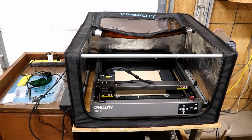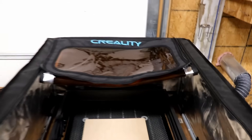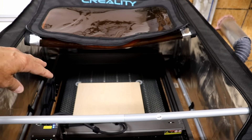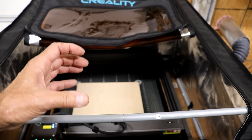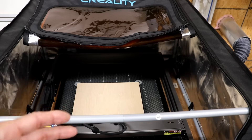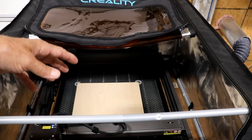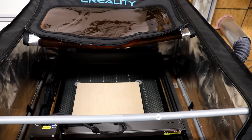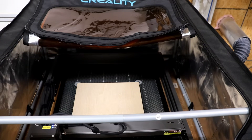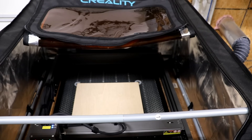Let me show you another little trick: see the washers in the corners? I recommend you put washers under the corners of your material. The reason is, once you've cut through, the part that you're cutting will drop just slightly, and that way you know it's been cut all the way through. With a laser cutter you often can't tell if it cut through or not. If it didn't, just send the job again. But with the material raised on washers, you can see at a glance if it fell through.